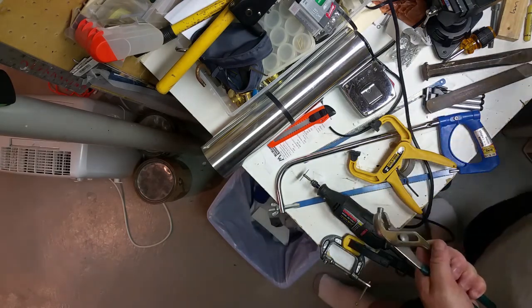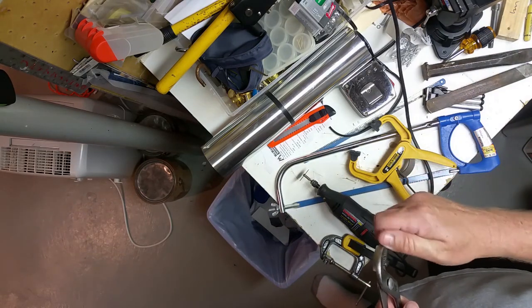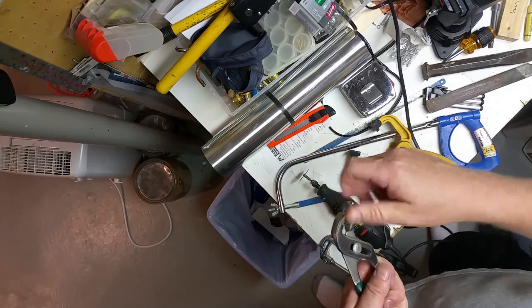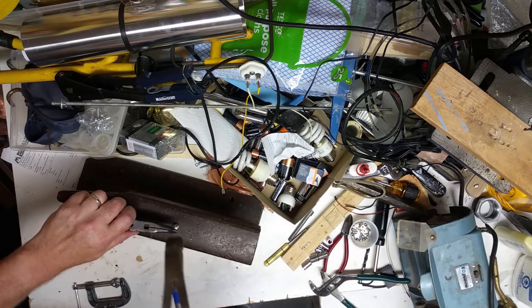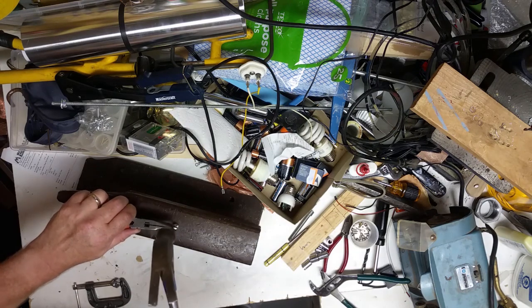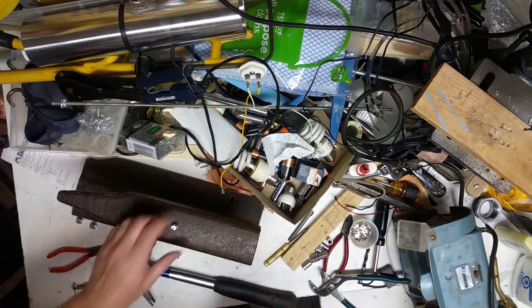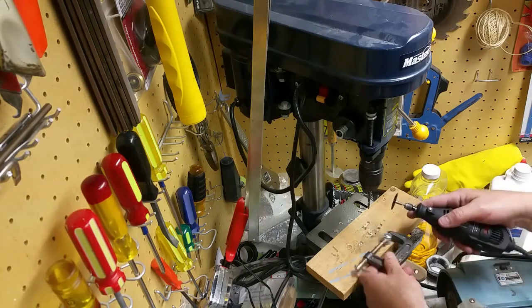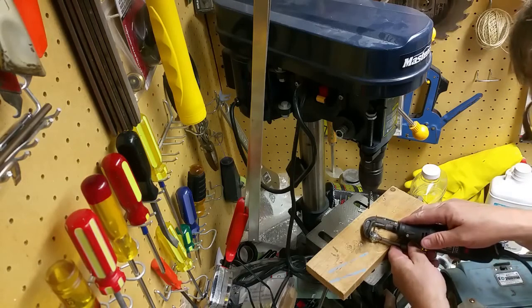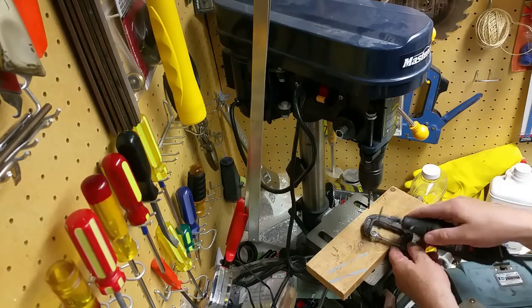Let's go find the nut. There it is — and yeah, it goes on. On to the next step, which is center punching the cut-off side of that bolt so that the drill bit can find the center and actually stay there. Unfortunately, I don't have a center punch so I used a nail, which was a cheap crappy nail and bent. So I used the Dremel again and just cut a little X marks the spot in the middle so that my drill bit can find the center and not wander around and make evil noises and shatter and all kinds of bad stuff.